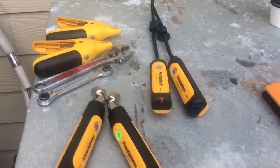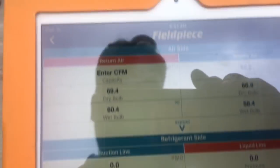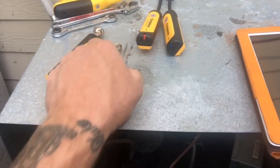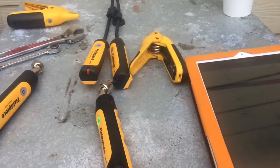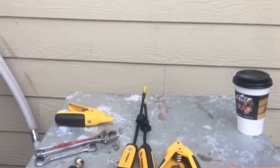I just turned all the probes on, just reached set point and turned off — so that's good. Checking the app on the iPad, they've all connected and loaded up. I'm going to hook up the outside ones and put the low side probes inside the walk-in box for a refrigeration test. We'll see if it broadcasts all the way through this wall — through the back door to the kitchen and into the walk-in box. If it does, this is going to be really cool for us refrigeration guys.